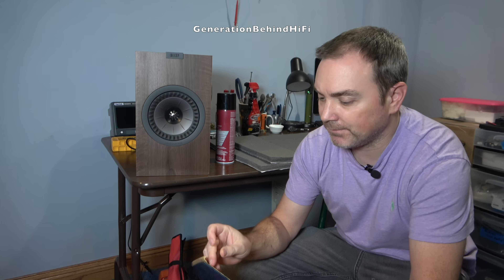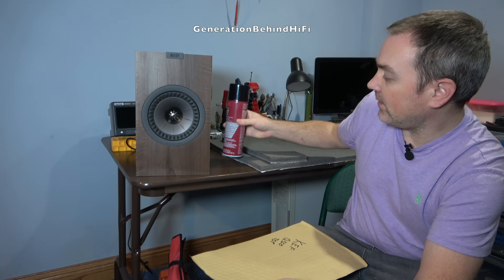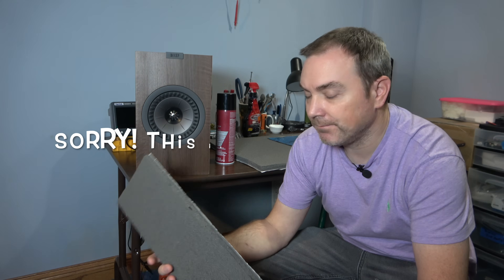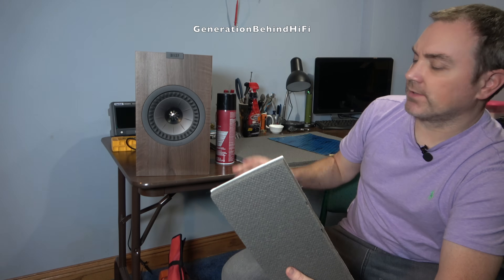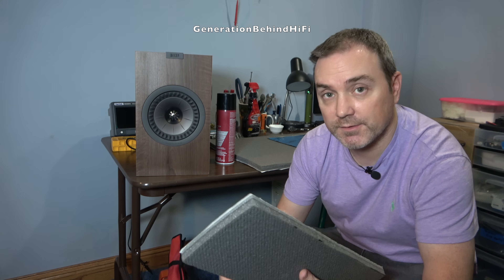There are two products I'm going to be using. One is from Amazon Basics — it's a sound deadening material with a sticky back that you can apply to surfaces. I really want good adhesion, so I'm going to be using 3M Super 77 spray adhesive on the back side before applying it to the cabinet walls. Then once that's dry, I'll be using a product from a company called Sonic Barrier — their one-inch foam damping material applied to most of the side walls. I'm hoping these two products will take care of those cabinet resonances I was seeing in the impedance sweep.